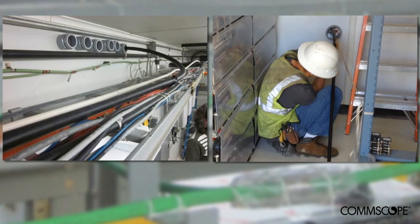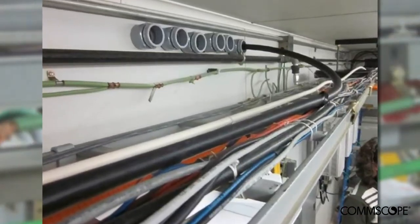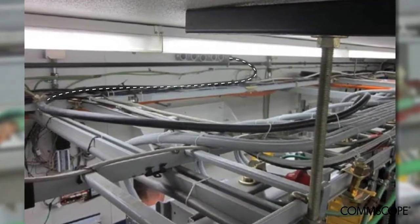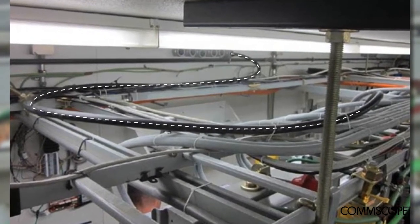As illustrated in these still photos, this can be done one of two ways depending upon where the entrance conduit is positioned on the wall. For CRAN hub sites where the entrance conduit is placed up high near the ceiling, the cable assembly is more easily transitioned from the conduit onto the ladder racking. Notice how the cable assembly is routed along the ladder racking from the conduit over to the relay rack where the fiber panels will be installed.